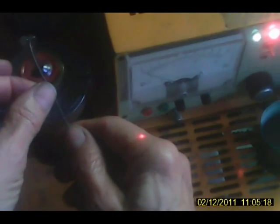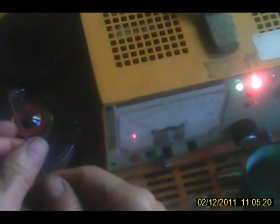All right. I'm blowing helium onto the joint, looking for any movement at all on the needle. We get none at all. Not the slightest leak, okay? So we've got a good seal.